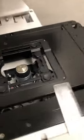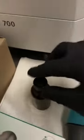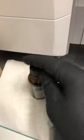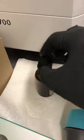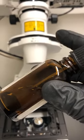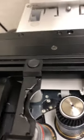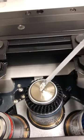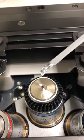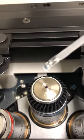This is relevant to us because we just switched this objective and we need to put oil on it. To apply oil, I'm going to use this oil bottle — we don't keep a lot of oil in them. I'll dip the plastic spatula into the oil and gently touch it to the front face of the objective. That's all we need; this is actually on the high side — you can even use less than that.